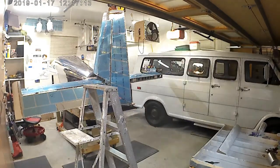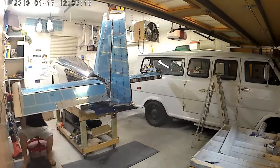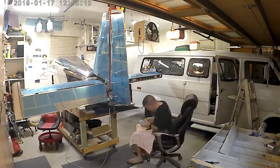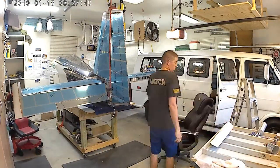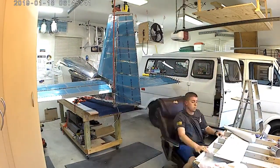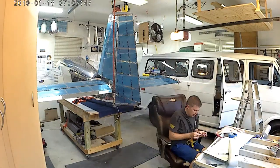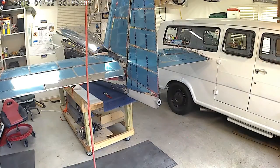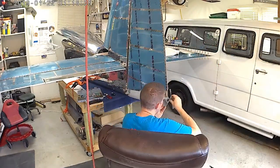This is pretty much wrapping up to the final conclusion of the empennage — for the most part everything is complete. One of the tougher parts, or at least more time consuming, was making the aluminum strips and then adhering them to the fiberglass. I found that resin really wasn't doing it, so I went with two part epoxy from Home Depot and that finally did it. The resin just would not have a glue-like hold, and every time I would go to drill a hole I would essentially just push the aluminum piece right off the fiberglass. So if you are going to do the aluminum strip thing, you definitely want to use two part epoxy.